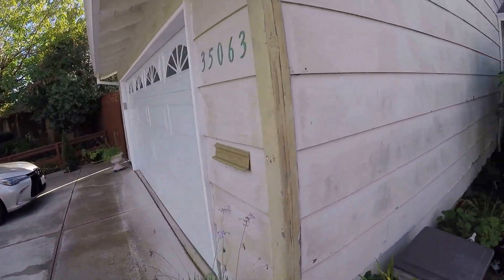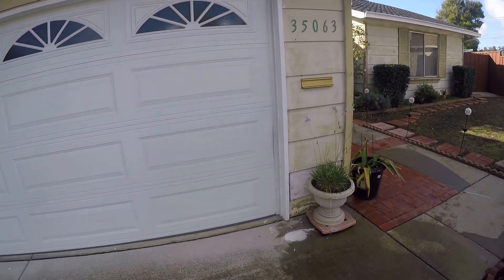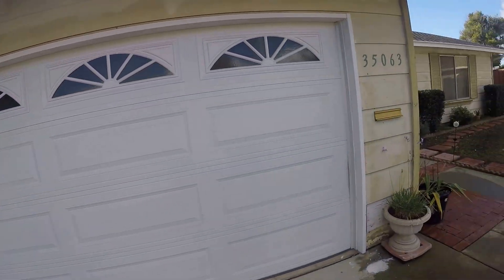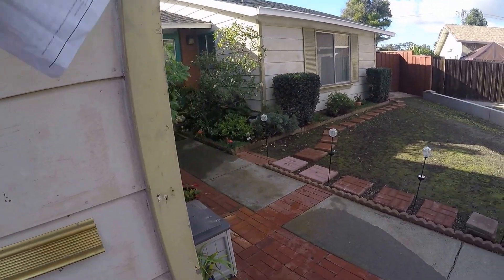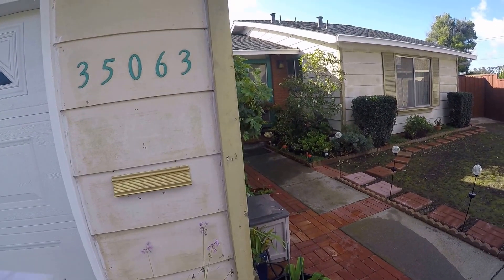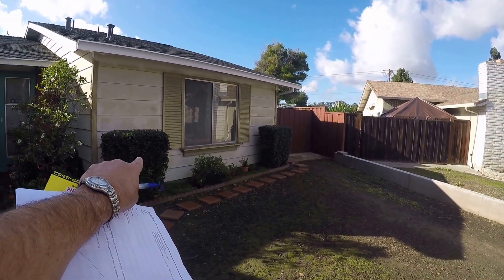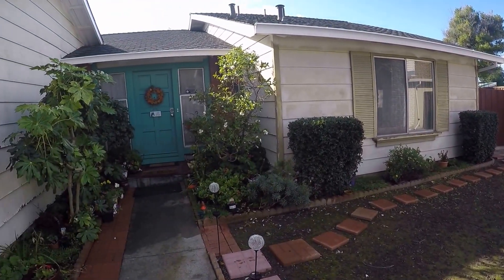Coming to the front, the trim corners are going to come off. There's a not-so-nice trim around the garage door that's going to get removed, and we're going to put in stucco foam trim. We're also going to do a little decorative trim — the owner wants a piece that comes up and outlines the window, maybe a one-by-four or two-by-six. On this window, we'll also put stucco foam trim on the bottom and around the whole window.